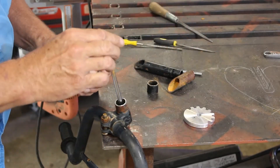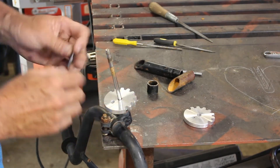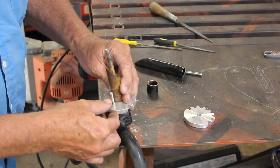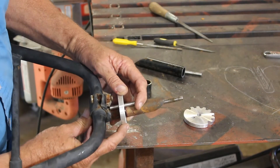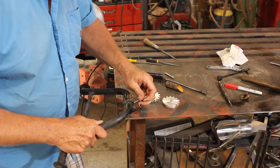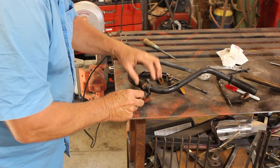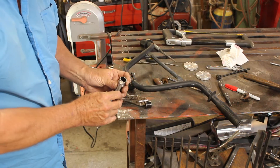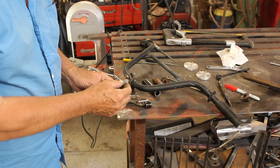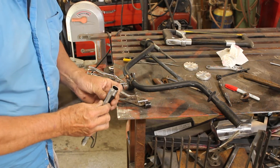Here's how this is going to work. I want to make sure one side is a little prettier than the other, so I want that side up. We've got this pin and then the other half of the gooseneck — I think that's going to work. I'll just tack that in. I apparently located that hole perfectly. So I'm going to clamp this onto here and tack it without the aluminum anywhere near. I just came to the realization that I should probably make it so I can remove the gears in case something bad happens or they get worn out — so they can be replaced. So instead of welding on both the top and the bottom, I will weld them to the top and then make a receptacle for the bottom.